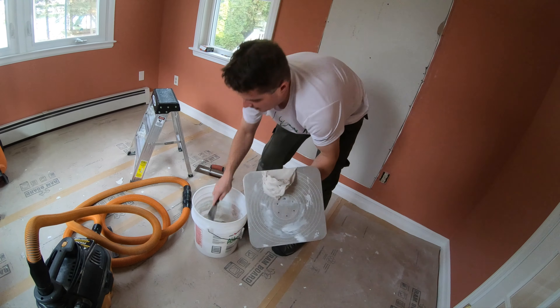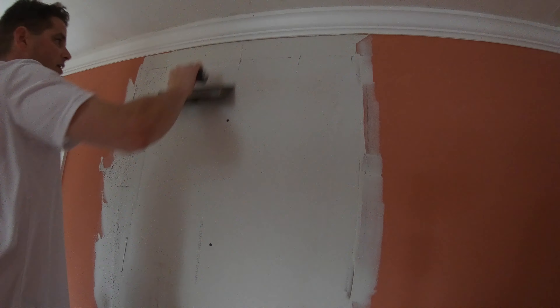I'll come up to the top and work it back to the crown and do that little jiggle — that effectively leaves the mud right in the corner without making a huge mess. I'll clean that off, then swipe down; when I swipe down it cleans off both edges. You can see the mud starts to mushroom out, which is a good thing. Come up here and skim tight, skim tight, skim tight. I'll clean this off — there's a line there and I can just get rid of that.